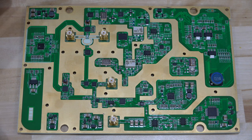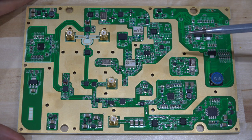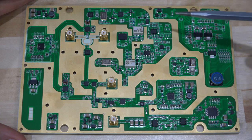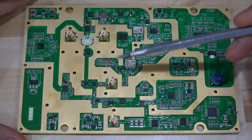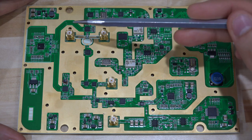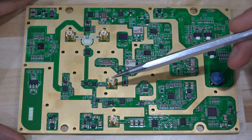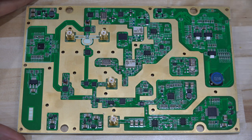Here is the RF board — it looks really nice. It's a four-layer board using very nice components, with a clean design and good soldering. At first glance, you wouldn't be able to tell this apart from something from Keysight or Rohde & Schwarz. There are four SMAs: one permanently terminated into 50 ohms, port 1, port 2, and the AF low frequency port.